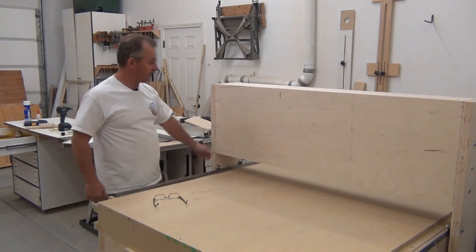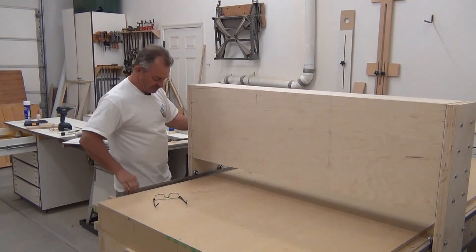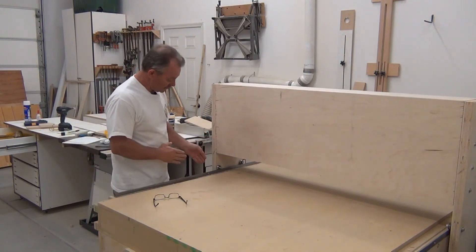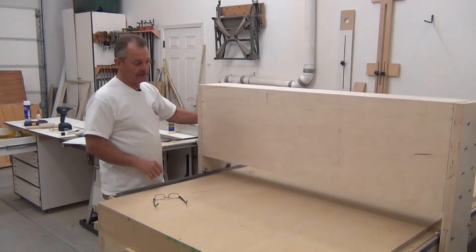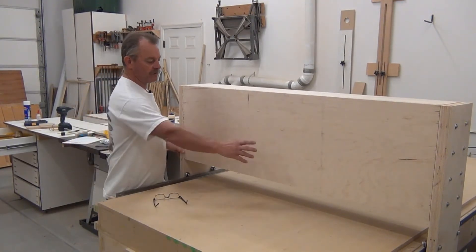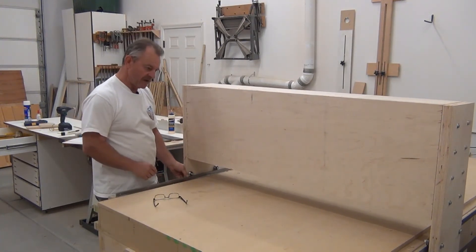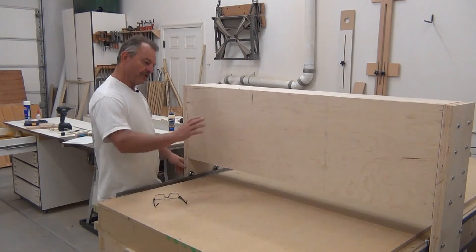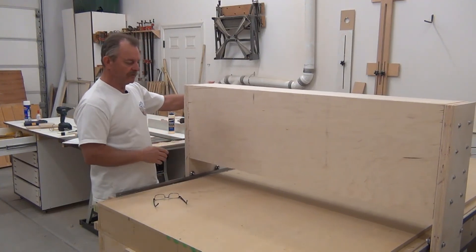It rolls real well. If you still have a problem with yours not rolling and it's a little tight, you can loosen up the angle iron on one side and push it down a little at a time — the rail will find where it needs to be. My concern is that as the router works back and forth and reaches one end, driven only by one rack and pinion or one ball screw, this thing is going to rack and tweak. So we're going to drive it on both sides to alleviate that problem, and you can sync those motors perfectly.